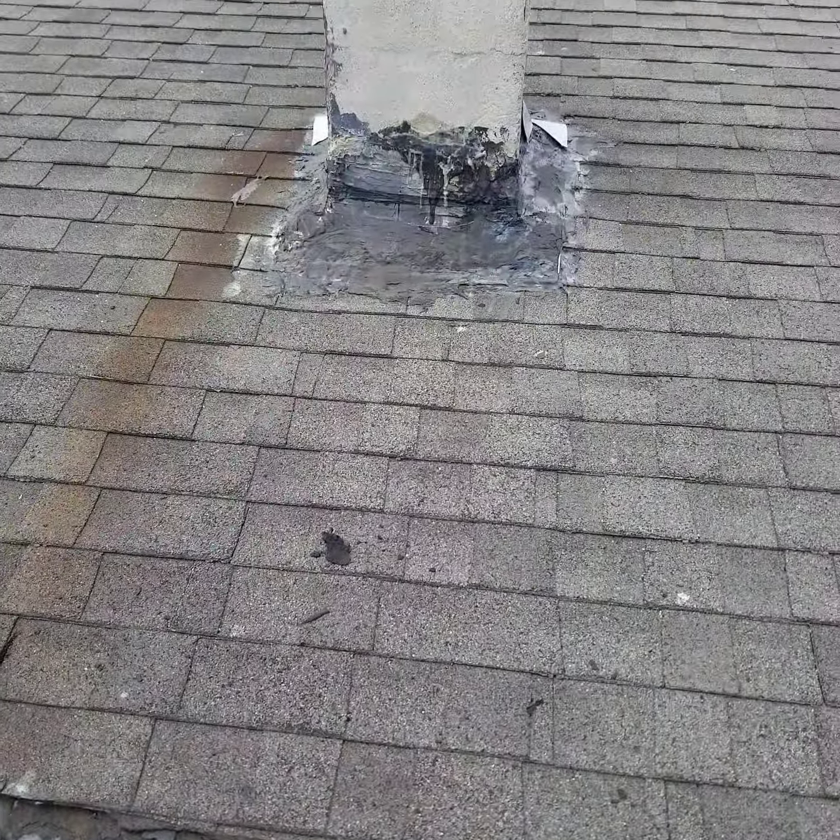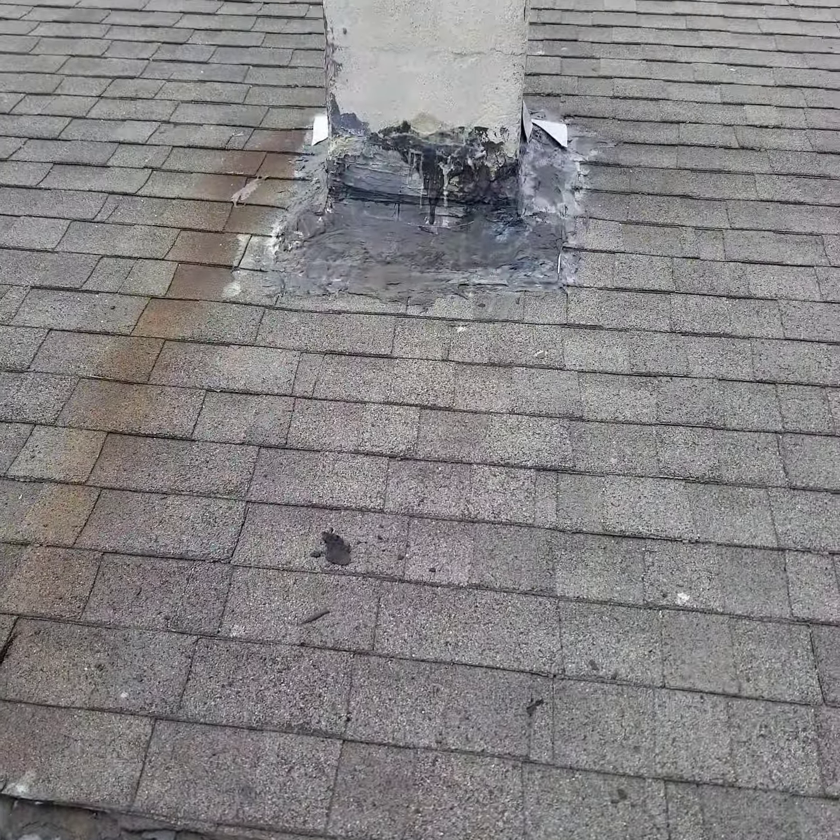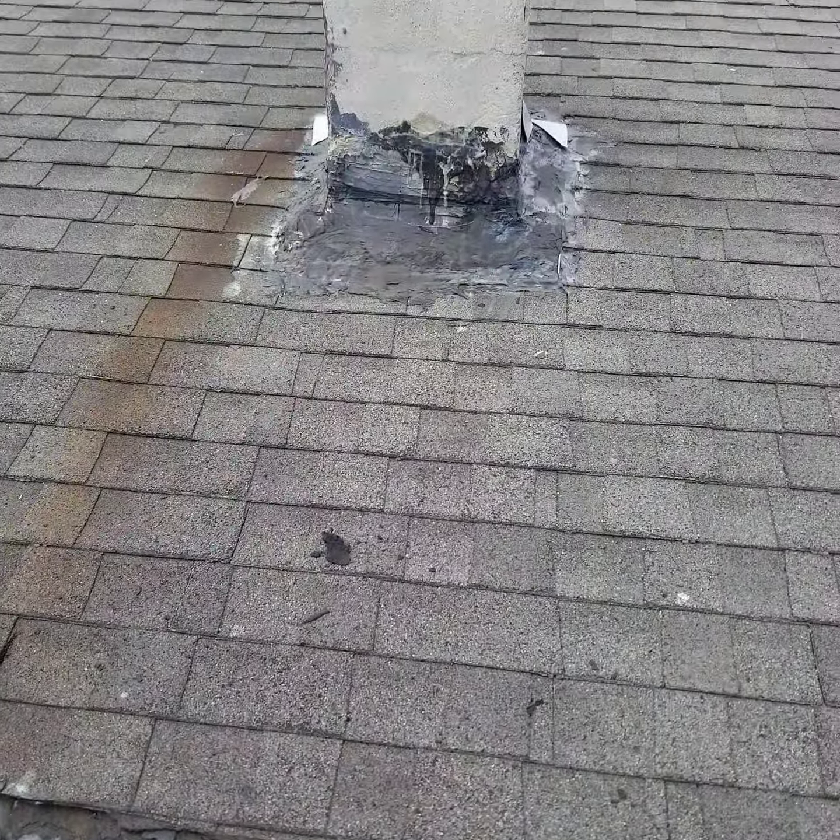As you can see, they've got layers of old material here which are in pretty bad shape. I'm going to rip out more layers, put tar on the transition, and later overlap with the rubber membrane — hopefully this will stop the leak. Then I'll get matching shingle sheets to match the existing roof. Apparently all these penetrations have some sort of moisture penetration — it's not much, but water does get in. That's all, bye.